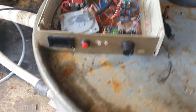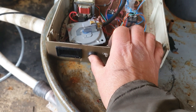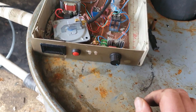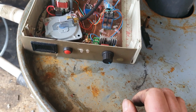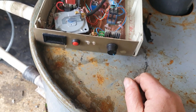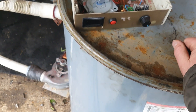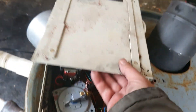That's the front of the control panel. The idea was you press a button which overrode all the interlocks to get it up and running, and then when you released it, if everything was working as it should and it saw all the proper parameters coming in, it carried on running. If it didn't see everything it was expecting, it would just switch off.